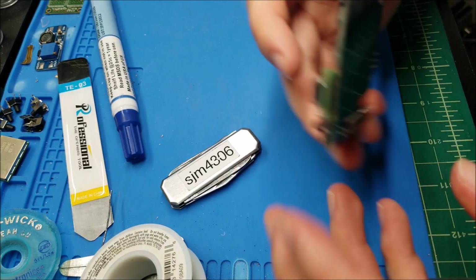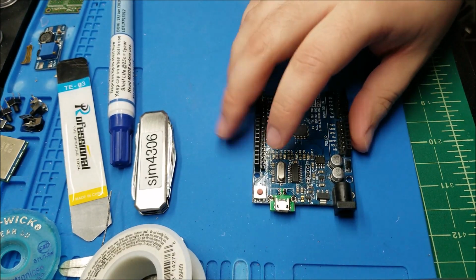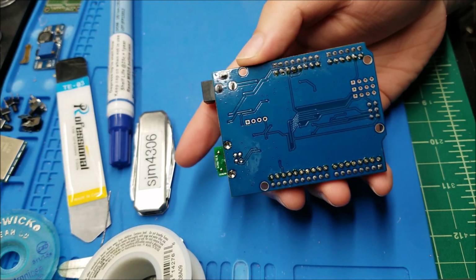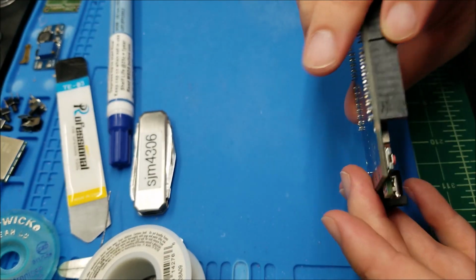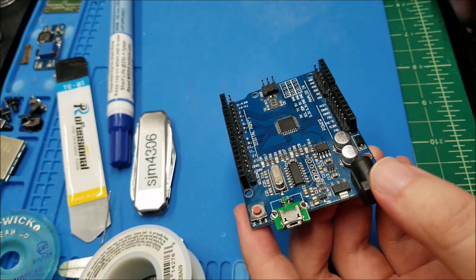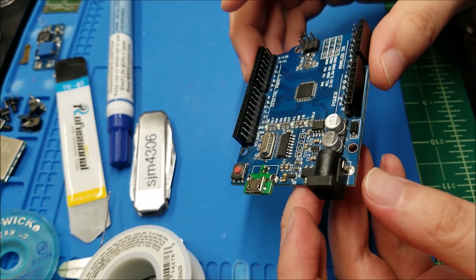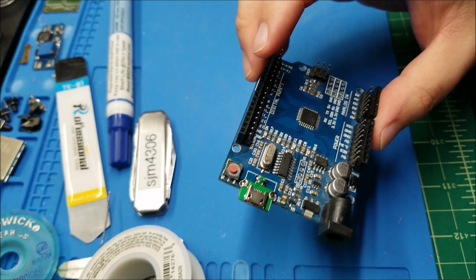So now, before I actually power this on, I am going to use a multimeter and just check the pins to make sure that they are soldered through. And I guess it might be a good idea, let's pull out the microscope and look at this underneath the microscope to see how everything's soldered. So give me 1 second to set that up.